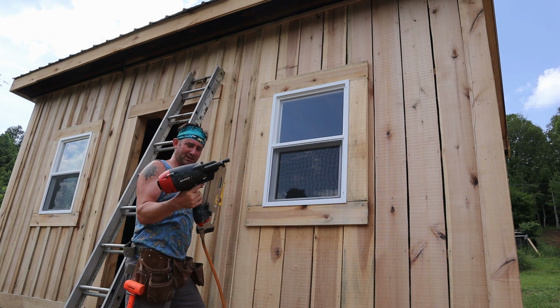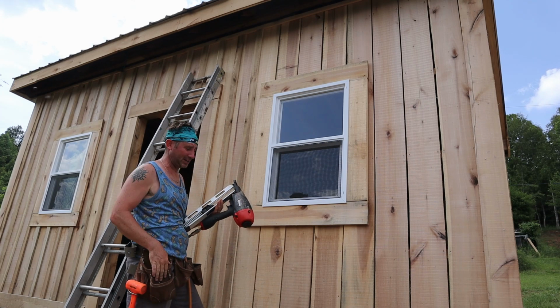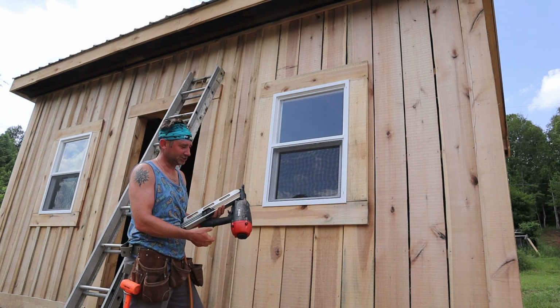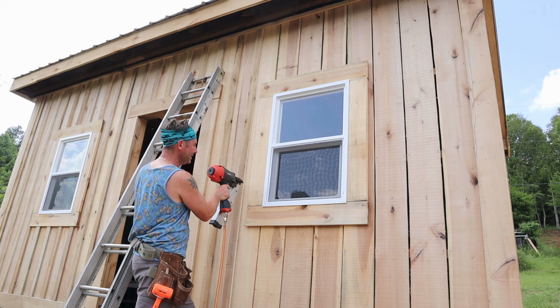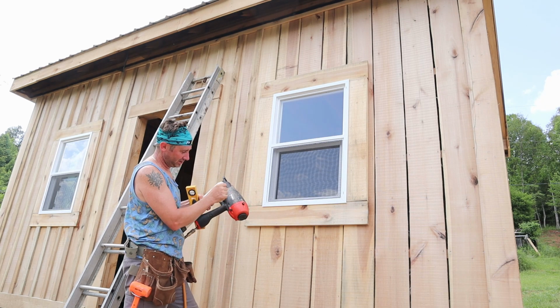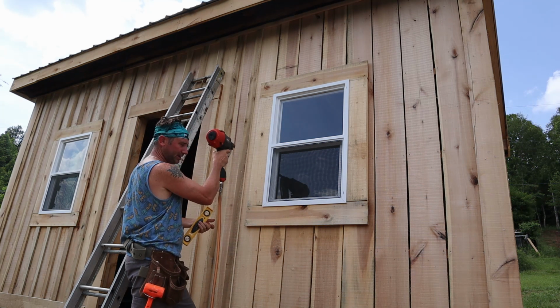So speaking of this nailer, it's got 2 modes. It's got the multi-fire mode, which is what I normally keep it on, and there's a switch here for a single shot mode. In single shot mode, you have to depress the head like that and then pull the trigger. The multi-shot mode, I call it bump mode. You just pull the trigger and then bump it and it'll fire.